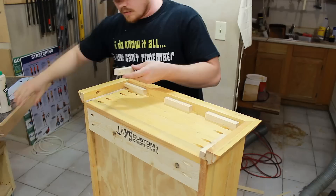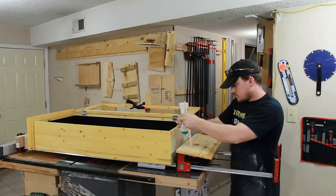These two pieces are going to form a French cleat system. When this piece is mounted on the wall, the cabinet will hook right over the top of it. I'm going to use some glue blocks to reinforce this crown molding.